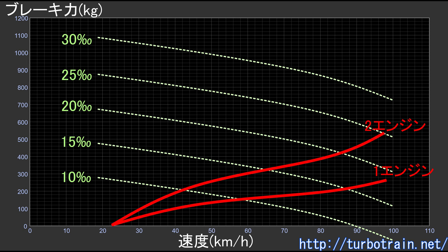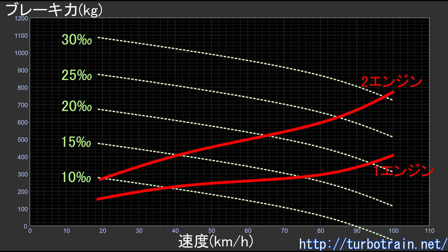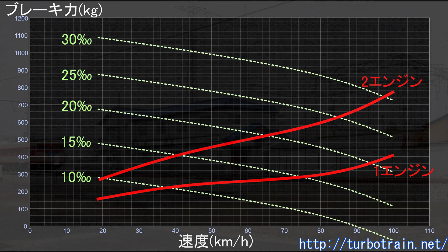Therefore, it was decided to stop supplying fuel to the engine and modify the engine to run purely on power from the wheels. Since the control circuit of a conventional vehicle cannot maintain a direct connection when the engine is stopped, a circuit was added to avoid this problem. This increased the braking force to a little over 25 kg per ton near maximum speed. However, this value is weak, not even obtaining a deceleration of 1 km per hour per second. When viewed as a downhill-grade holding brake, the balancing speed on a 25 per mil downhill grade is 85 km per hour. The use of friction brakes is still unavoidable on mountain routes.